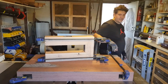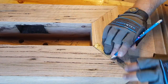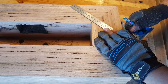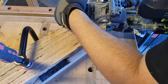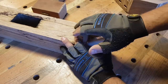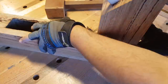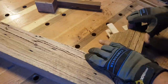Okay, so what you see me doing here is marking out some positions for dominoes to reinforce these miter joints. I'm using the Domino XL with some fairly big 12mm dominoes — four in each of those miter joints, two deep ones in that part there, and shallow ones closer to the edge.